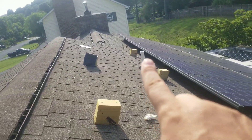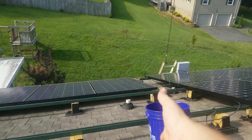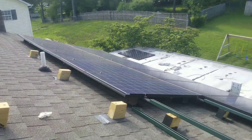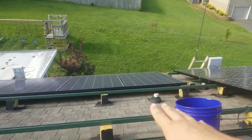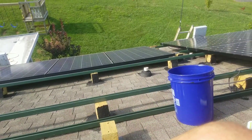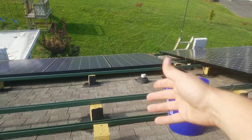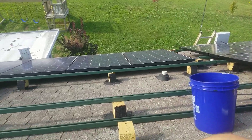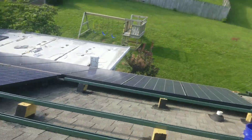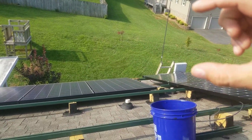You can see that PVC pipe coming up — you can see where I cut it off down here. All it needs is air to suck through. It doesn't really have to be rained on or anything, it just needs air to be sucked through. Whenever the toilet flushes, air can vent in and out. So whenever the toilet flushes, air sucks inside and then vents back out later — in and out vents. On the backside, you won't see any of the vent pipes anymore, but they'll be covered by the solar panels and have about that far above them, so they can still vent.